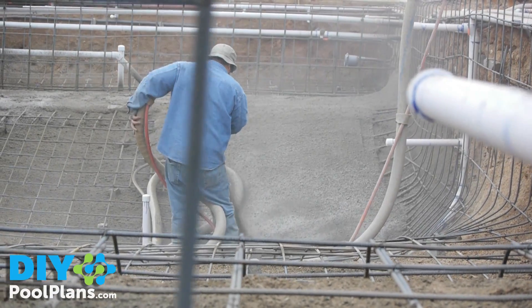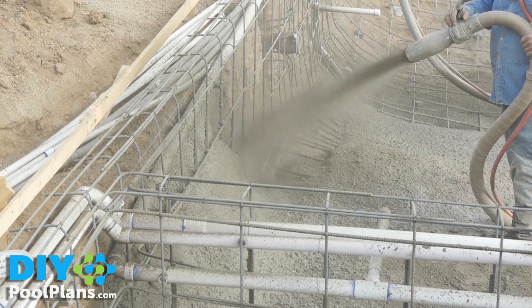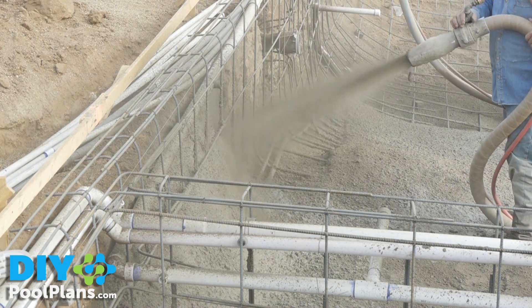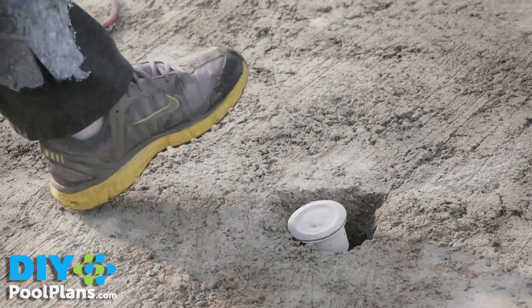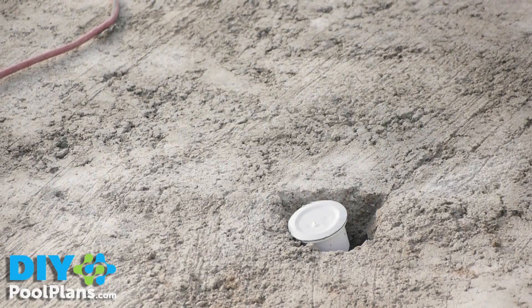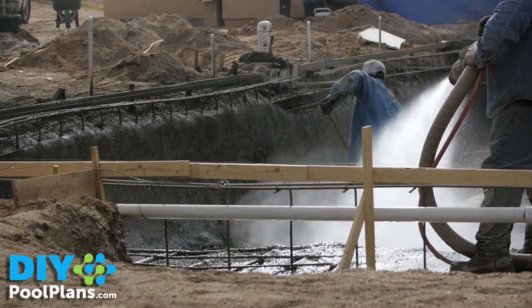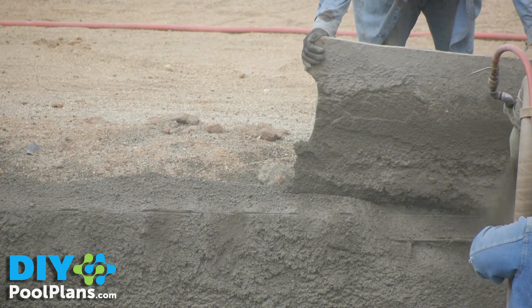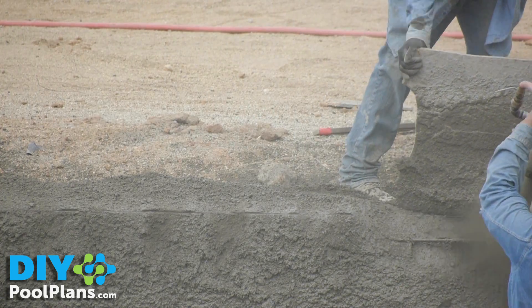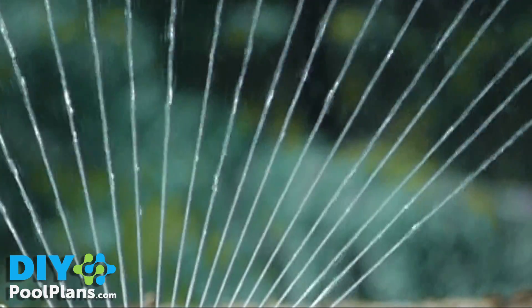Today in this video, we will cover the inspection checklist for gunite and you'll get a first hand look at how a pool is built. Verify with the gunite contractor any changes, umbrella holes, or water features you may have added. Specify with your gunite contractor the area for rebound, which is leftover gunite. Check to see if a gunite inspector is required by your site. Once gunite is placed, make sure to water it two times a day for seven days.